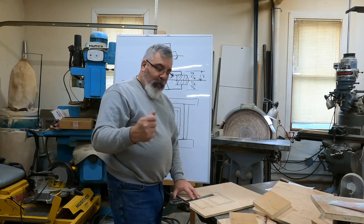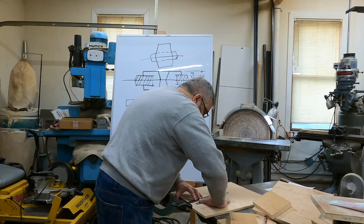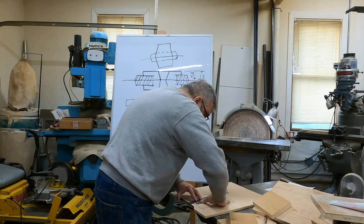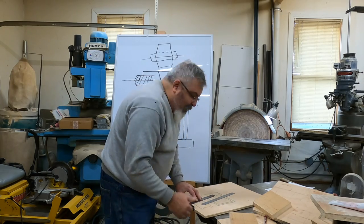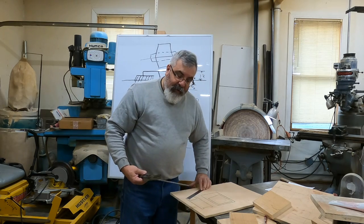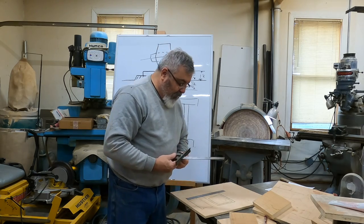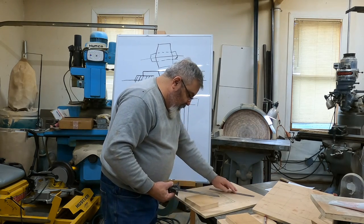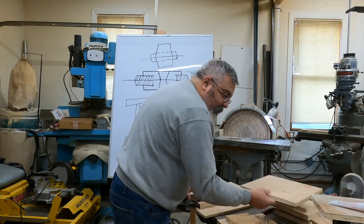So just take your ruler, put your angle, and this is what this is doing. It's not a big deal here, but I just have my 12 inch blade in this protractor, and it's not running all the way up into my layout, so you can extend it with a smaller ruler here. All right, I'm getting around 14-15 degrees, but I got this set, so all I need to do really is take it on here, and I gotta go minus, right?